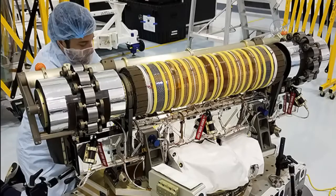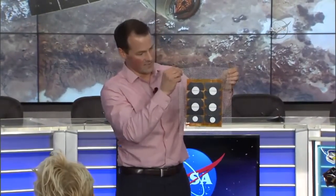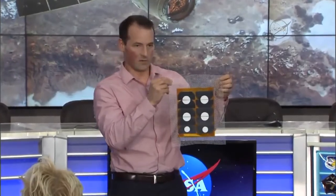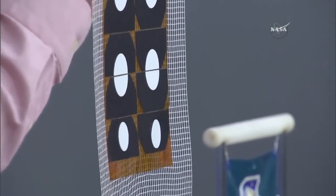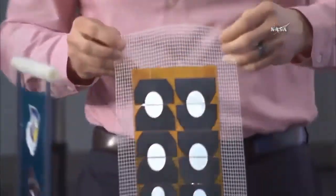We'll be measuring with some accelerometers, but primarily with a technique called photogrammetry. This is a sample of the actual blanket — an open weave mesh with a Kapton layer joined to it, and photovoltaic cells (in this case, aluminum mass simulators). Those white targets are used for photogrammetry, where at least two station cameras watch the wing at all times, tracking the position of these targets. Using a triangulation technique, we can back out the precise relative positions of the targets and reconstruct the vibration frequencies and amplitudes of the wing.